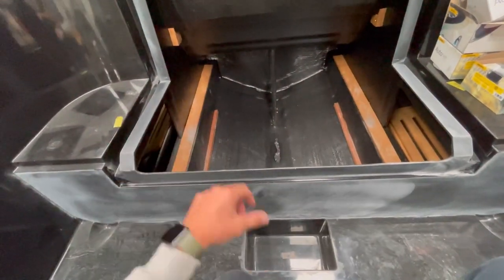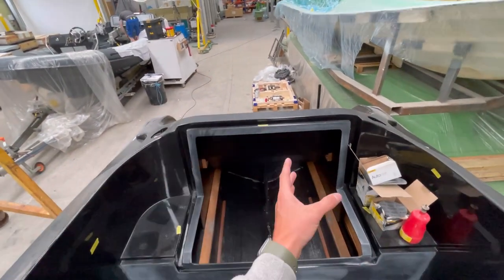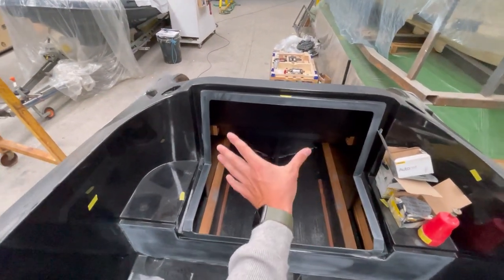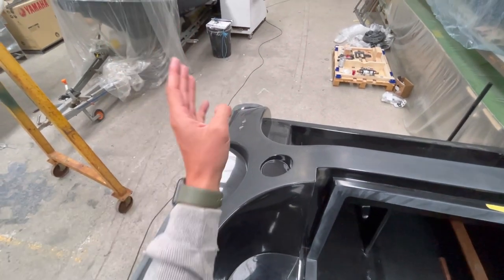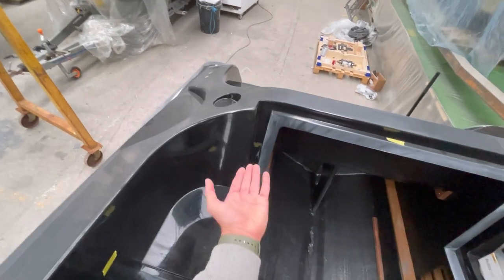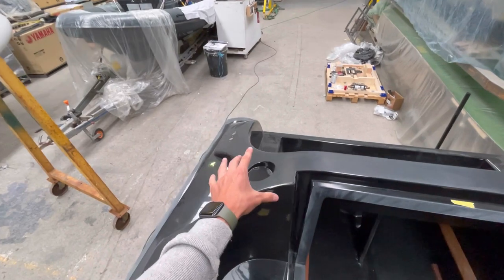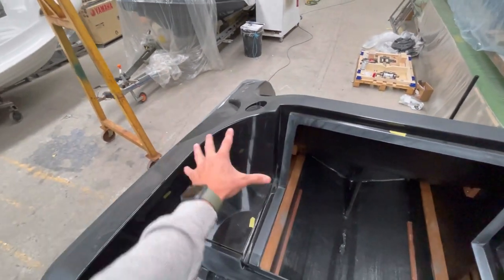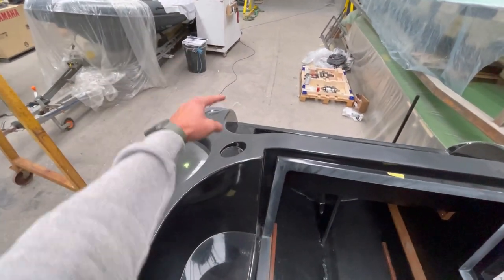This will all be finished with beautiful hand-cut teak. When we fit structural secondary items such as the tow mast, it's bolted through this piece of core. You'll also see these two pre-drilled holes ready for a high-quality Sea Smart cleat — you can fit the cleat and then access the backing plate underneath, making that cleat really strong. What makes that cleat location even stronger is that it uses this globally strong deck molding for internal strength, rather than a secondary molding back seat with a cleat fitted, which wouldn't be as strong.